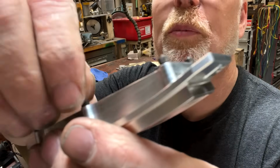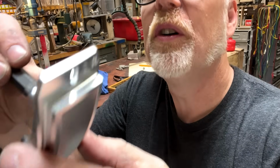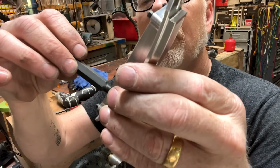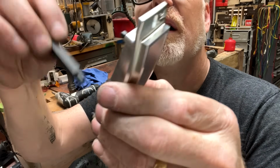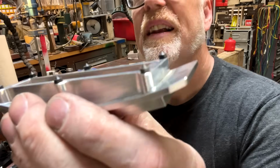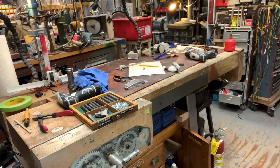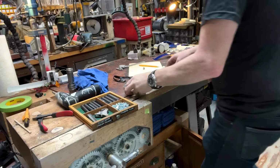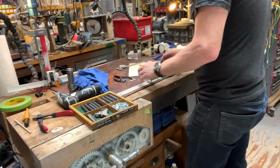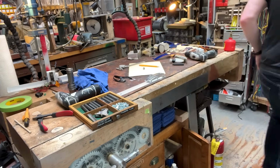And so what you do is you put these into the holes. You can actually use the holder, tighten these in so that they're all level. Great. Now, I take these transfer plugs and I put them on a piece of aluminum. This soft hardware store aluminum will be perfect for my needs. And we're going to give this a good thwack in order to transfer the holes.